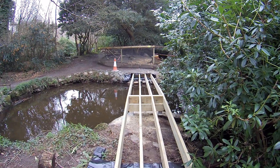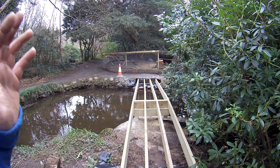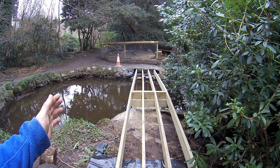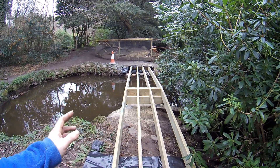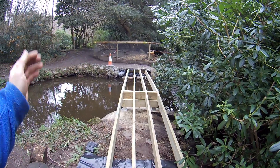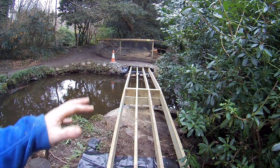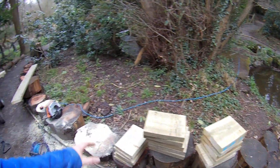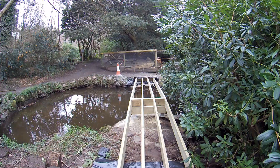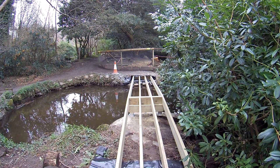In the last video I was having a bit of trouble because I was trying to work out where the handrails are going, but I've had a good night's sleep and I've worked out what I'm doing with those now, so that's all marked out. The next step is to put the noggins in between the beams — they'll tie all the beams together so it's one big structure and stop the beams from twisting. I've made a start already this morning and cut all the noggins to size, so let's get on and put those in.